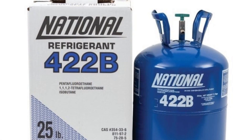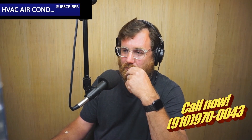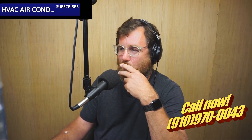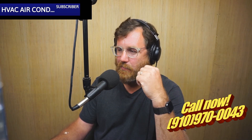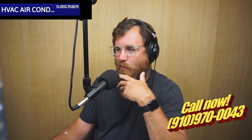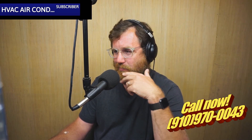It finally got to where I'd accept it as good enough. I used R422B because that's what the supplier had, and it seemed to be working pretty well. It works similarly to R22 — the pressure is a little bit lower. The charge is a little bit higher, and I noticed that when looking at the pressures; I was thinking it was running a bit low because R22 was in my head.